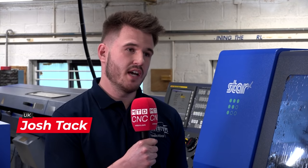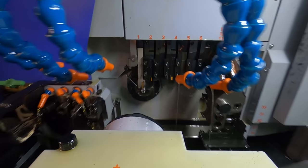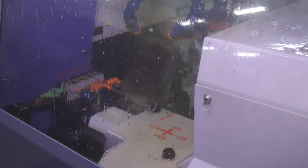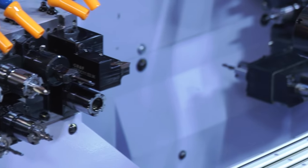What's better with the J2? Starting with the obvious differences, we've got eight tools on the head 2 on the Type 2 Star. That gives us a lot more options, especially for milling. On the straight SR20J we have four tools, which tends to mean we have to polar mill if we were to mill shapes and different hexagons. So essentially you've got double the amount of tools on the back working spindle. That's right — we can put in more tools now. If tools break, we can just change a little bit in the program and carry on running.